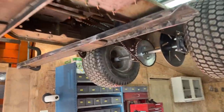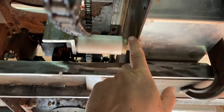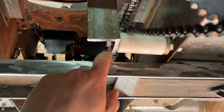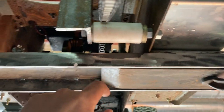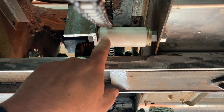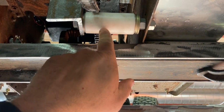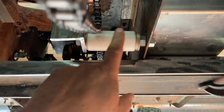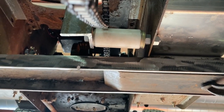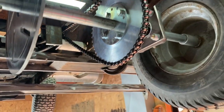Because we kept throwing chains, we came up with a tensioner. We got a Teflon roller and just bolted it to the frame of the tractor, then ran a piece of angle iron straight up to the frame and welded it. The good thing is it rolls, so the chain won't wear through it quickly. A lot of even factory four-wheelers have Teflon guides for chains like that. Someday it'll wear out, but we flip it around and wear out the other side - two uses out of one block. It's really thick so I think it'll last a long time, and I've got enough material to make ten more.